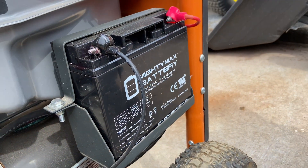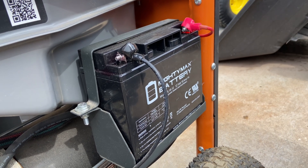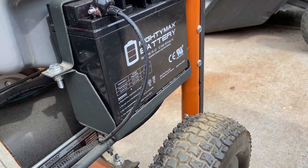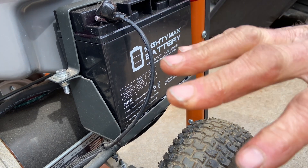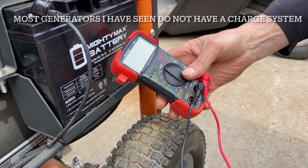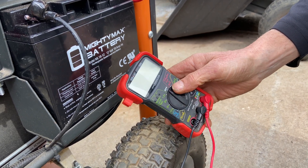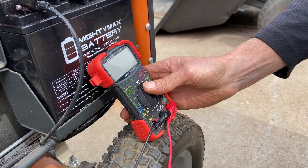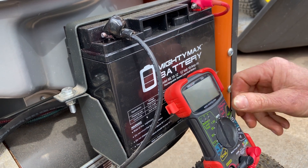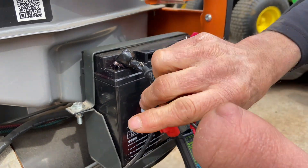The battery is over here. I recommend charging the battery regularly — once a month or once every other month. These batteries do stay charged a long time. Some generators have a charging system on the engine; some don't. What we're going to do today is use a digital meter — I'll put a link in the description if you need one; I got this on Amazon. We're going to use DC voltage on this to find out what the battery reads. We're going to check the voltage before we start it, then check it again after we start it. We put negative to negative and positive to positive.